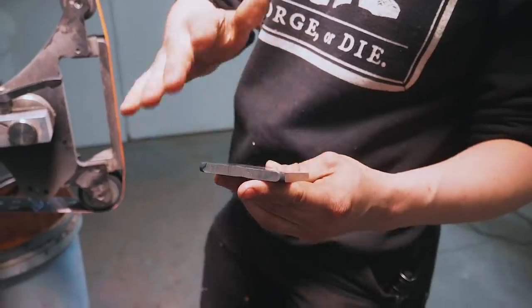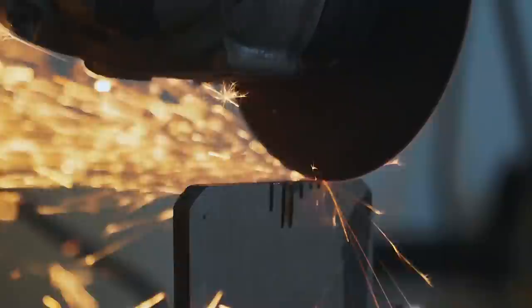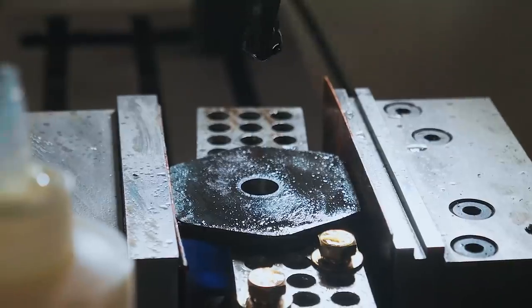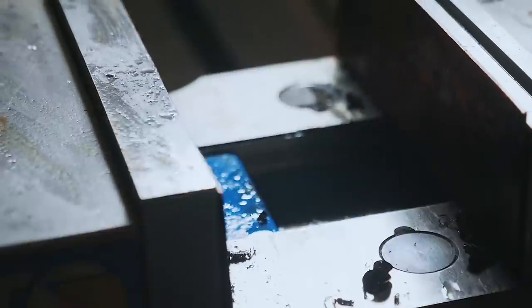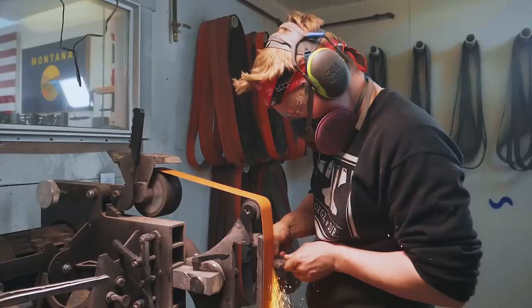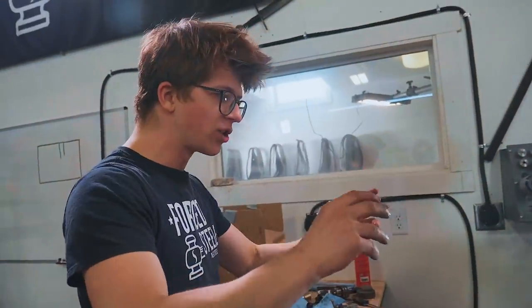I'm going to make sure I keep all four of those points in the same area. I'm going to grab a sharpie, trace it on, and start profiling. I've got my 5/8 inch hole in there. I'm going to remove this bit and look for another end mill — I want some carbide that can hog. This will do a nice job of that. I've got to fuss with this some more and see if I can tighten up this collet. That's not working — it's just spinning. I can't get it to hold on tight enough to not spin.